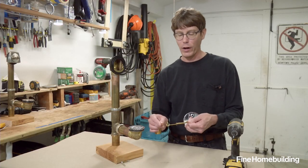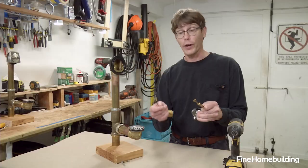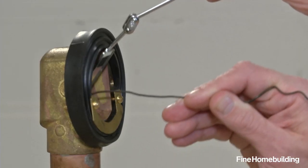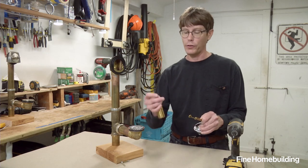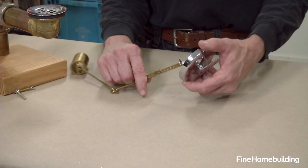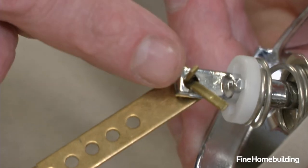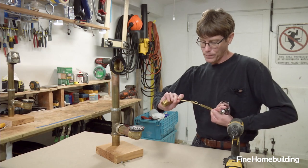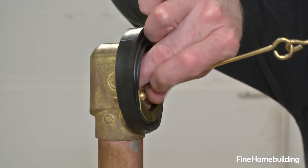I've had this rod come off, and if it does, you're going to have to hook it with a piece of wire. An inspection mirror and a flashlight will make it easier. You might try to grab it with a magnet, but it's made of brass so that's not going to work. Make sure this connection isn't broken — if it is, replace this part called the trip lever. Reattach the rod and then feed the stopper back into the drain.